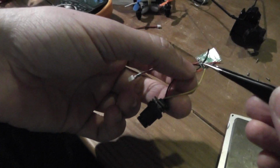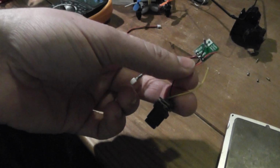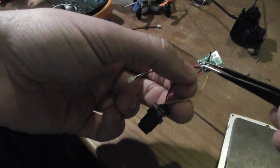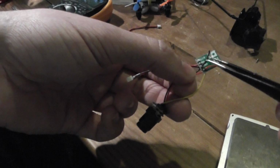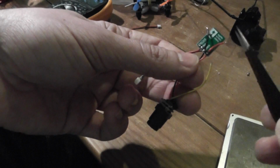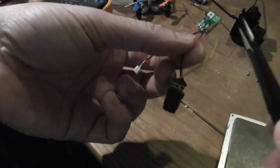So I already tuned the Pololu to output 3.85 volts. In my point of view, that is the right voltage to remove any white stripe interference and to keep the VTX from warming so much. So at this wire's extremities we have 3.85, and it will also power the camera with that voltage.